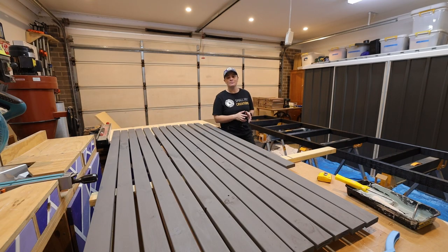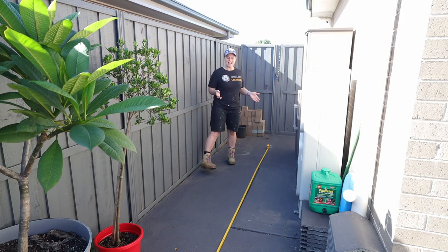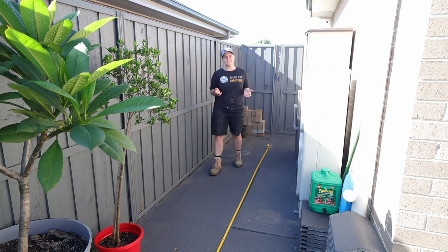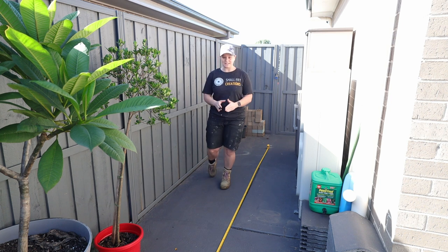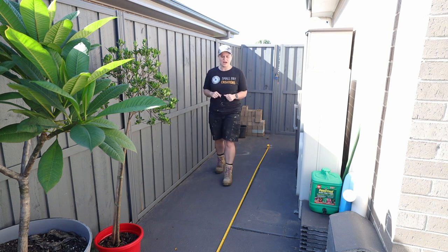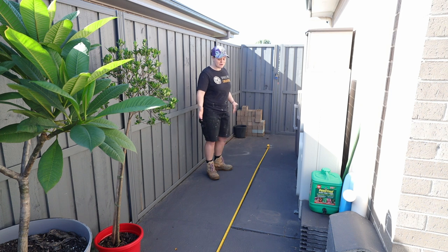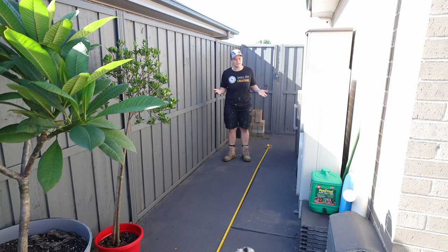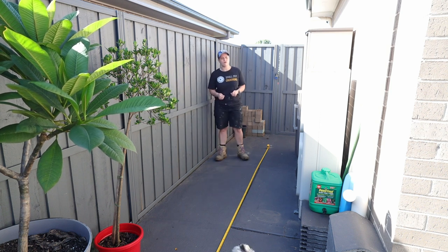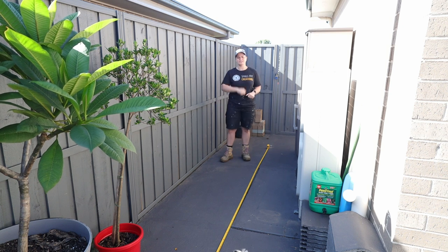It's the next day — the paint is all dry and the deck is ready to go together. The shed is ready to go outside so I can have my workshop back. We're down the narrow side of the house where the shed is going. We laid out a tape measure to play around with placement, because the measurements on the website are wrong and we're already pushed for space due to the air conditioning unit and the fence. We already have a concrete slab, but it's sloping away from the house for water runoff — we obviously want to keep that, so we've built a deck to bring it up onto a level surface. There'll be an air gap under the deck to allow water to continue to run off.